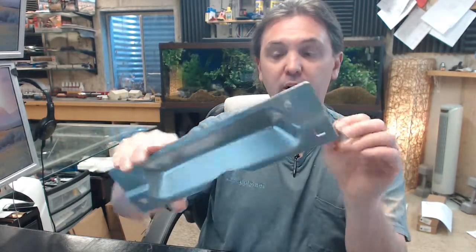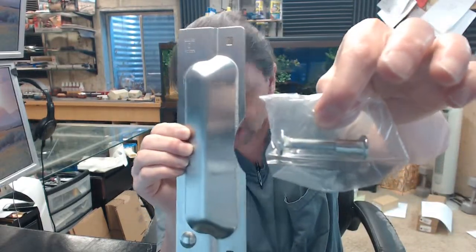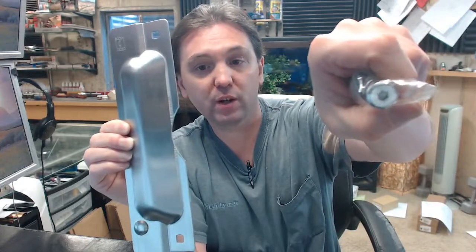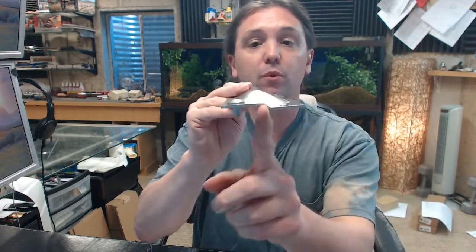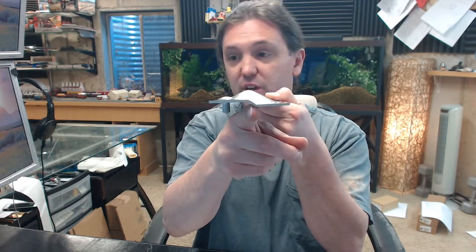Now what sets this latch guard apart from others is the pin. So you've got your 2 square punch outs here for your security screws. You're going to have a 5/16 bolt that's in there, a carriage bolt, and that is going to have the square head underneath the carriage bolt so that when it's installed it can't be turned. And the inside is going to be an Allen wrench, tamper resistant, sort of female part of this sex bolt installation. Okay. Now, once you get that installed and the instructions call out, they want you to have a 3/16 of an inch margin from where this offset starts to the edge of the door. You need to kick that over enough so that your frame is going to fall in this space here, not closer to over here. Okay.